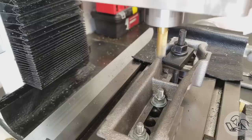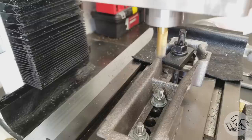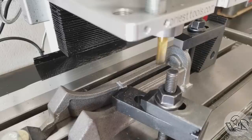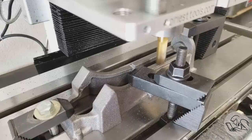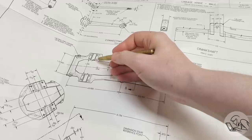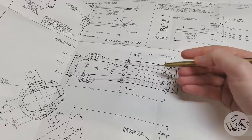First chips — I'm going to start by machining the bottom of the base to give myself something nice to sit on. You are going to get a serious case of model engineer fingers; this is all cast iron, it's messy stuff. Generally with machining these castings you're trying to average out the error and create reference surfaces. I decided to reference everything off the crosshead slides, so I machined these down to the right dimension.